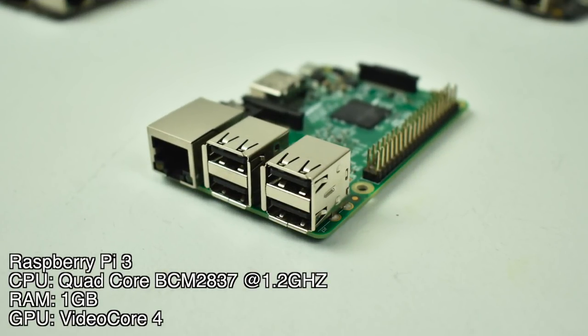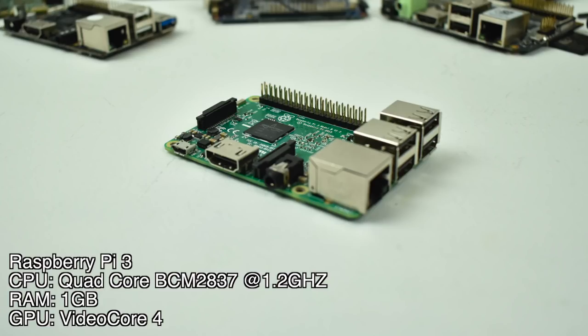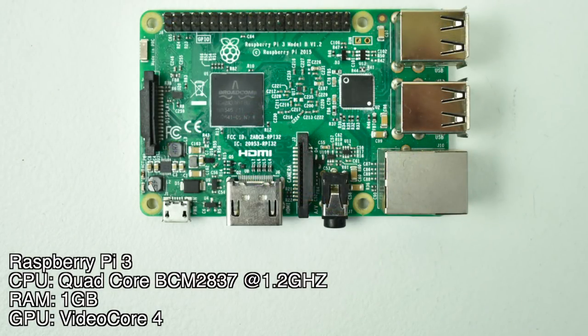On to number one — you can't deny it — it's the Raspberry Pi 3. Quad-core BCM2837 at 1.2 GHz. I've seen some people overclock up to 1.5 GHz, 1 gigabyte of RAM, and a VideoCore 4 GPU. It does struggle playing Dreamcast, N64, and PSP, and there are some other emulators that don't work well, but overall there are thousands of retro games you're able to play at full speed at a really reasonable price, even after factoring in a power supply, controller, and SD card. If you took all the people working on Odroid and ASUS SBC software combined, you still wouldn't have a quarter of the people working on Raspberry Pi 3 software. At $35, it's really hard to beat.